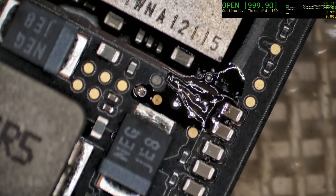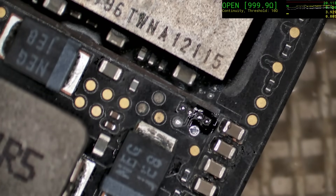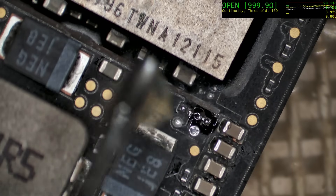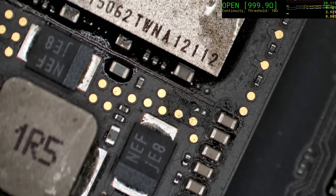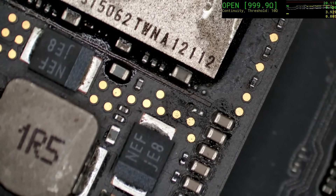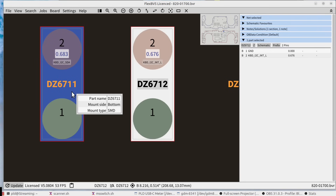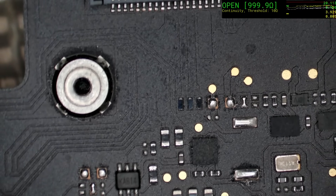We'll drop those, drop a pair of replacements on — there's heaps of solder for these little things, these little guys do not need much at all. We'll take them from a donor board. We've got one missing there — well we should have more than just one of these on the board, so we'll search elsewhere on the board for the same part. So 6711, 6712 — 6711 and 6712, they're the same thing. There's our shiny little friends.